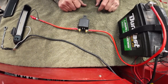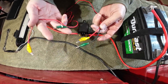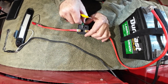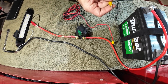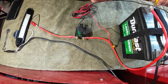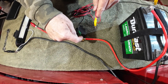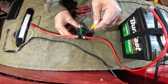Now let's look at how to close the switch. You'd be hardwiring this in your vehicle, but here we're just using jumper wires — red to red, black to black, simple as that. We're going to connect this wire here, connect the negative to the negative battery terminal and the positive to the positive side of the battery. Touching this brings positive current into the switch side, allowing current to flow out the negative back to battery — a complete circuit. Did you hear the click?